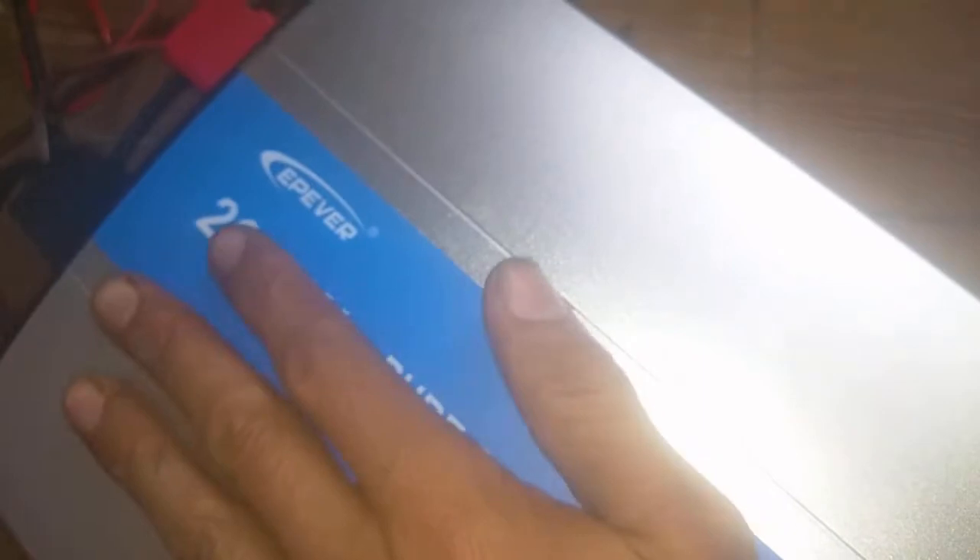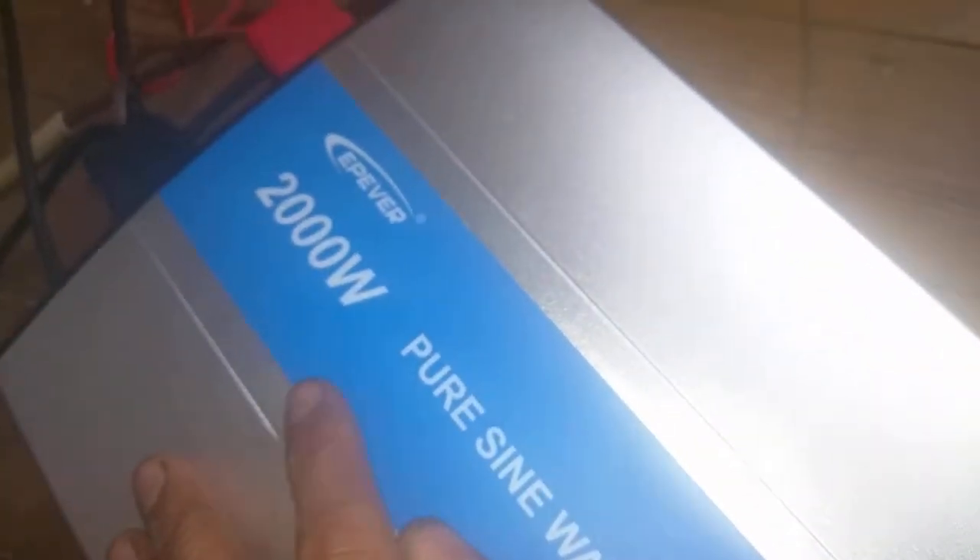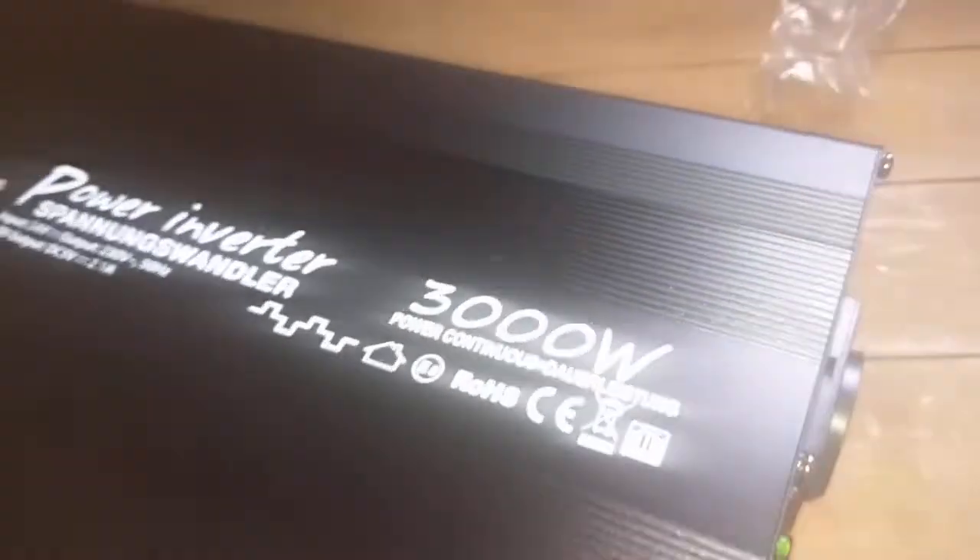You can see this other machine gets warm — I think it had around 0.6 amps or something for no-load current. It's only about 160 dollars or euros and it's a brand device, which is quite nice. However, this machine was being used with a big chainsaw or circular saw, so I would not try to start that with it. With the 3000 watt inverter it should not be a problem.